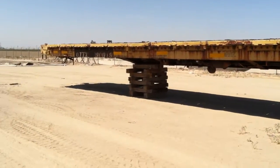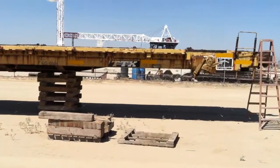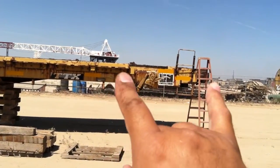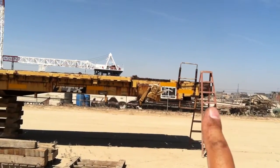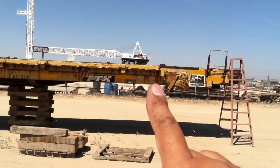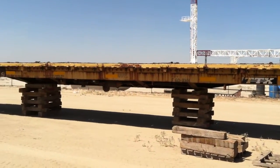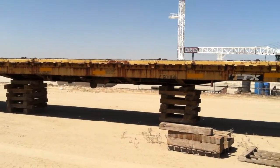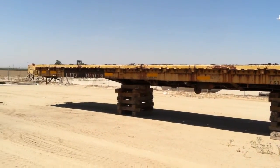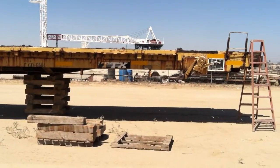It's not a bad way to do it if you have a smaller creek, but you could move your abutment further back. As we move our abutment further back, you can see that all these rail cars are a little bit deeper over here. Moving the abutment further back does make the rail car a little bit weaker and a little bit more bouncy. These rail cars are designed to hold a hundred tons, so even if we had to reduce that weight capacity it's usually not that big of a deal.